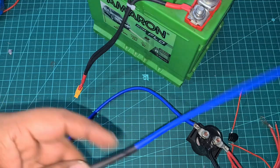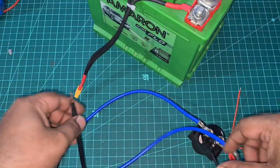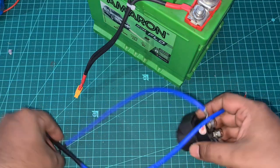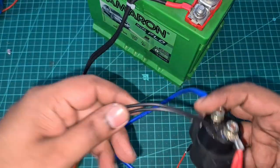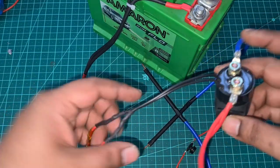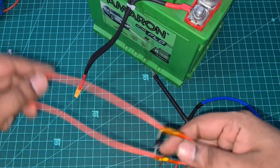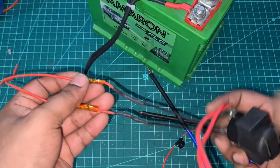The other end is the spot welding tips — for one of the ends I crimped a battery lug. These are the BIFRC spot welding tips. If you remember the previous video, I left a link at the top — go check that out. That spot welder MOSFET actually got burnt because I overused it, so I'm going to use the tips here. This is the coil switch — the wires where you supply 12 volts to turn the coil on and off.